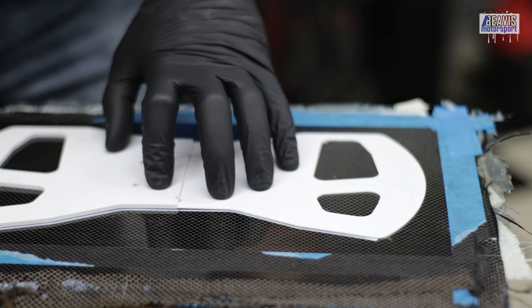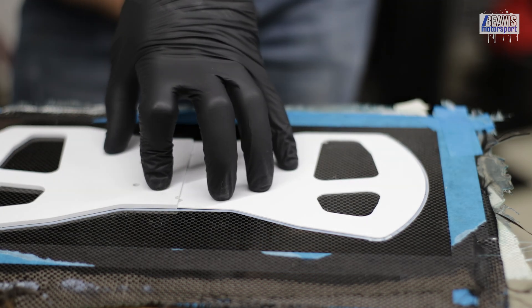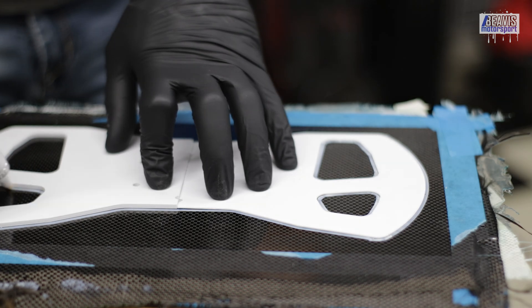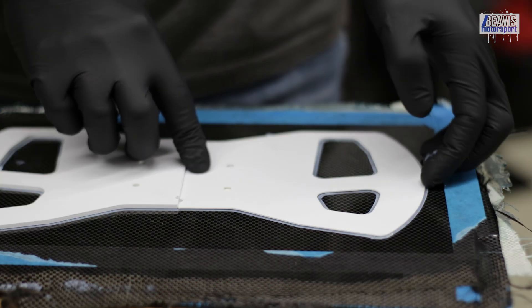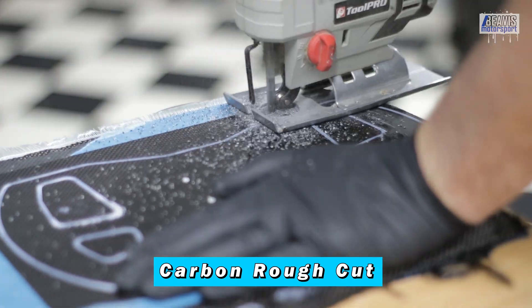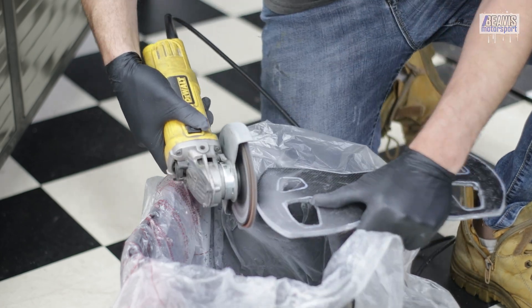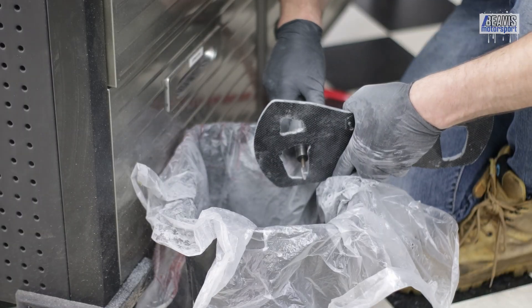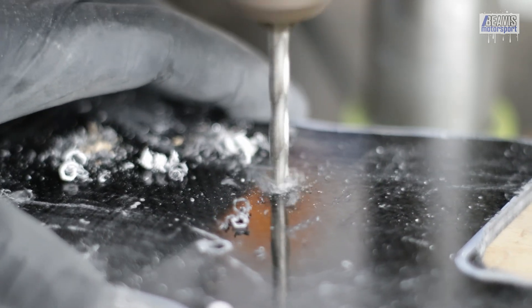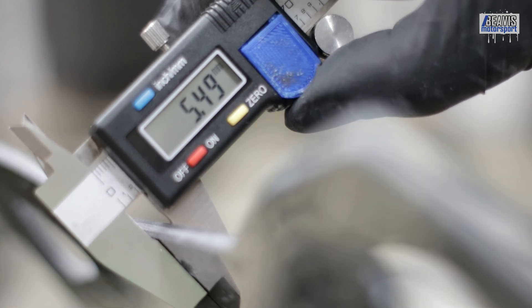To help mark out the shape for cutting, I 3D printed a template from my sketch, but simply printing the design on paper would work just as well. The shape can be traced — I'm using a white paint marker as it stands out on the carbon, though in hindsight I should have covered the panel in masking tape and used a pen, which would also protect the surface from scratches while cutting with the jigsaw. The rough shape was cut out using a jigsaw — a tedious process that wrecks jigsaw blades pretty quickly. I then used an angle grinder with a sanding flap wheel to tidy up the shape, and an air die grinder for hard-to-reach places. The standard 6-bolt steering wheel bolt pattern is drilled with a drill press: holes are 5mm in diameter at 70mm spacing. The final thickness of the carbon panel worked out to 5.5mm — it doesn't sound thick, but in the hand it feels sufficiently substantial.